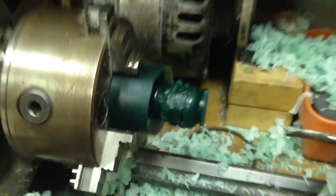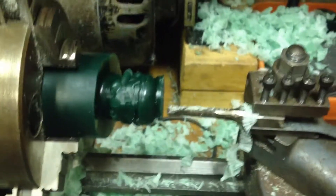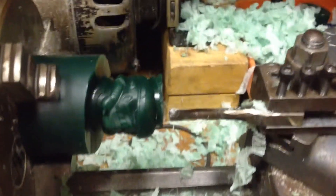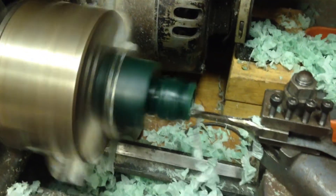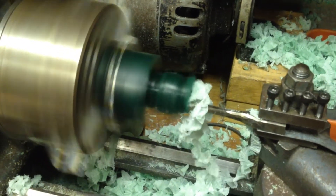I've got her chucked in a little lathe — I got this lathe just set up for doing this type of work. I don't bother messing with the mill too much; I got this just set up perfect. It doesn't have to be that exact — it is jewelry, not hip replacement parts. I know I've got it at the edge, and if it goes all the way down and I go nice and slow, no reason to rush. It took two hours to cut that wax, and all the designing and everything else — you don't need to rush. Just nice and easy.